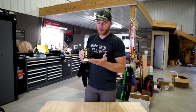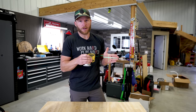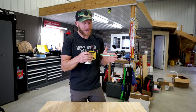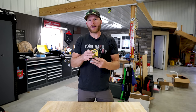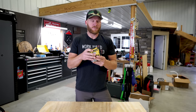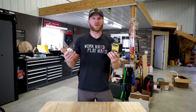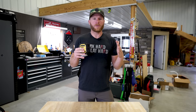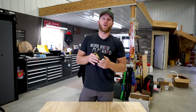This is a laser that gives you — and if I turn it on on my hand — you're going to see a horizontal laser line, a vertical laser line, and you've got a plumb dot that shines out the bottom and out the top. Now you're going to have accuracy within an eighth of an inch at 50 feet. So you're not going to be using this to lay out a large structure outdoors. You're going to want to use these indoors primarily, although if you're outdoors and working within a 10 to 20 foot range, we use them all the time on our job sites. At 100 foot you're going to probably lose your visibility, but that's what they say — you're going to get up to 100 foot of indoor visibility.